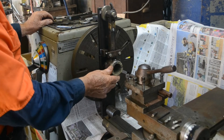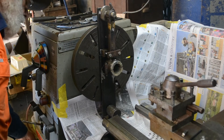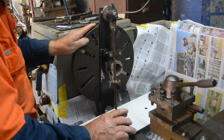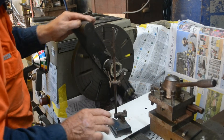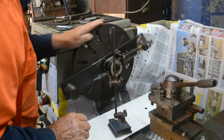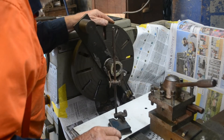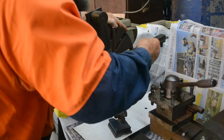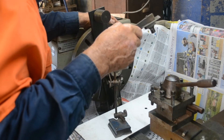It's firm enough there to position and to spin. Now we centralise it. My surface gauge — we just put it on the edge there, swing it around, and it's come out. That's the high spot. Take it back and we can just move it half that distance. A little bit more, and we've evened that up. That looks good.